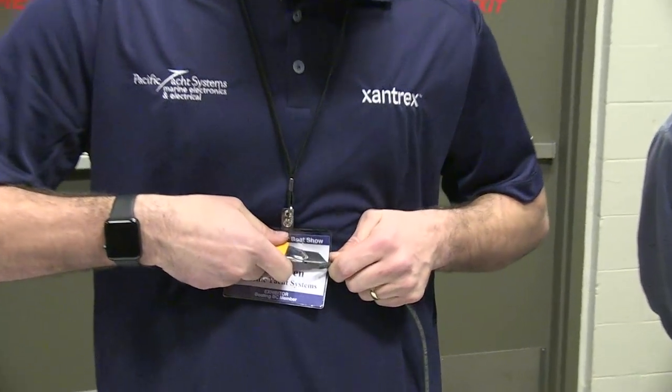With solar panels as well, how the positive and negative plugs are sitting on them, a lot of people think it's convenient to plug them in to carry it. If you then go and put that solar panel in the sun, it's shorted. So definitely don't do that. If you do take them off to store them, don't plug the ends into each other, because you'd need to get a new solar panel.